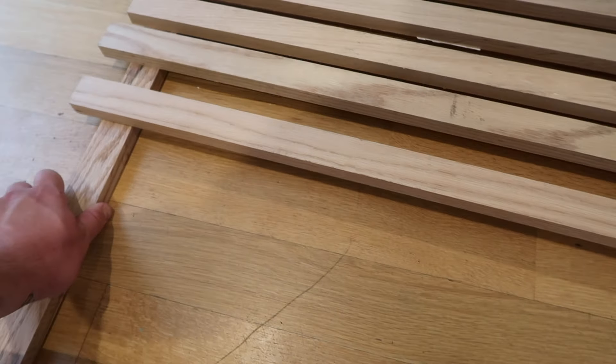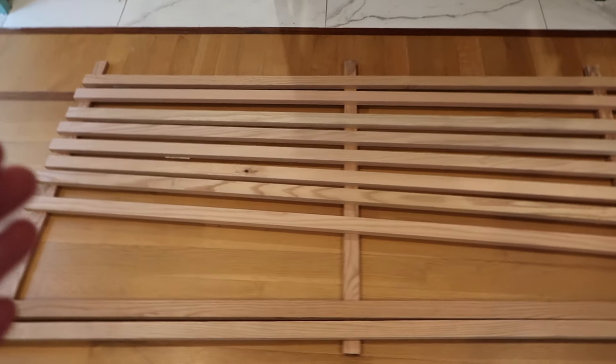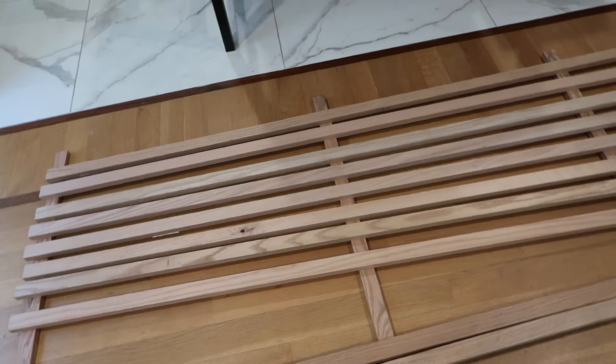You won't want a slat hanging off the end. Maybe we start a foot in, then every two feet after that. So: foot in, slat — two feet, slat at three feet — two more feet, slat at five feet — two more feet, seven feet — one more at eight feet. We'll do them two feet apart in the middle but one foot from each end. Now I'm going to screw in the five slats on the back at the top, then measure down from there. She wants an inch between each slat, so we'll see if we have enough. If not, I can trim off the bottom to make it just under 3 feet tall. Three feet is a pretty big headboard anyway — and we have hanging hardware, so even if it doesn't touch the bed frame, we can just hang it.